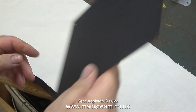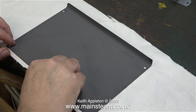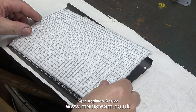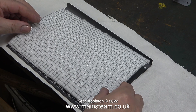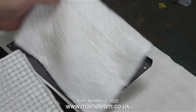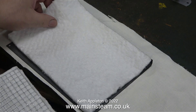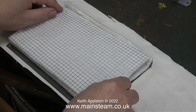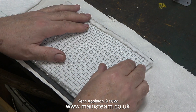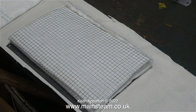That's the fun part over with — now for the difficult bit. I laid a couple of pieces of cloth on the workbench so I didn't scratch the outer part of the panel, and this is where the first of the two heat shields is going to be. A belt and braces approach is required here, so I'm using another piece of insulation material which I put on the side panel first, making sure that this piece of heat insulation material sticks up slightly at the top. The reason for doing this is to make sure that the top part of the side panel doesn't get too hot.